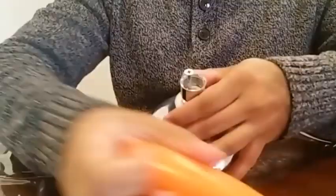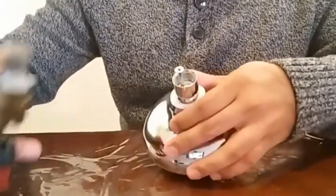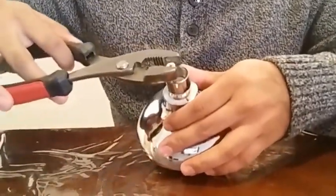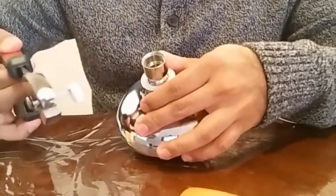Okay, it's not happening with just the screwdriver. So I screw this in, and I'm going to take a plier and just pull this gently. There you go, the flow restrictor is out.